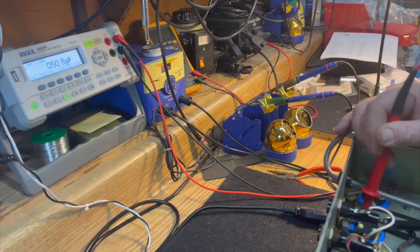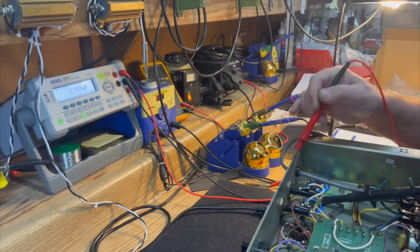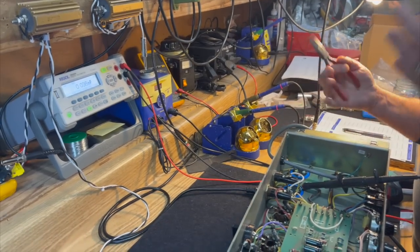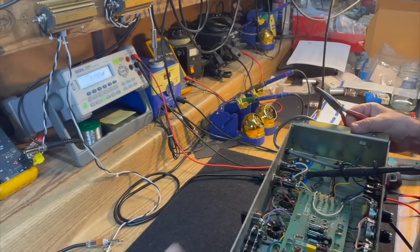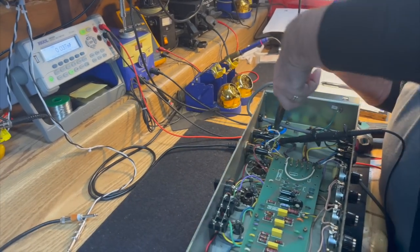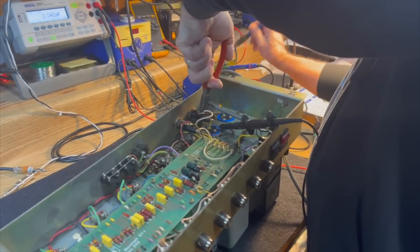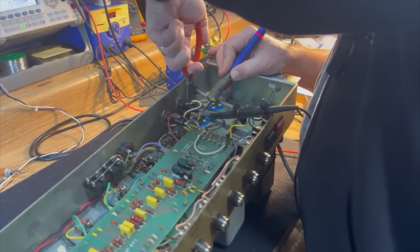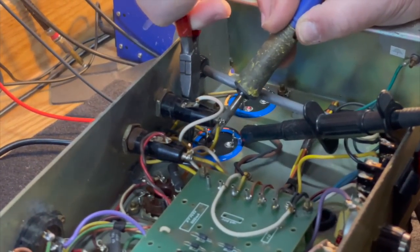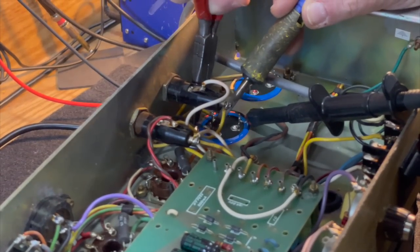So the effect of testing them in circuit was that, because they're coupled together with a resistor right around here somewhere, one of the characteristics of one is bleeding into the other side through the associated circuitry. And so it was affecting the reading of the two sections. All normal stuff. These capacitors so far, just reading from the standpoint of capacitance, are good. They're not shorted. They're not acting weird, interacting too much with the meter, where they would give you a false negative or a false positive.